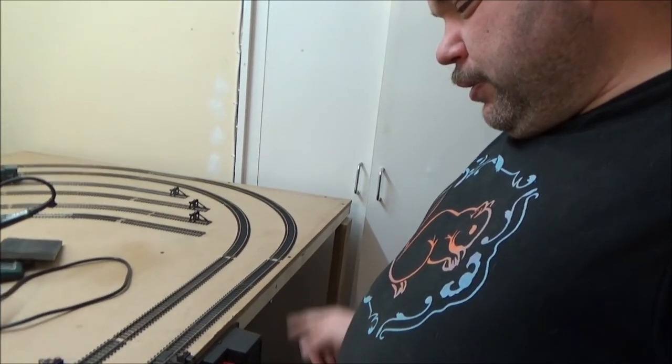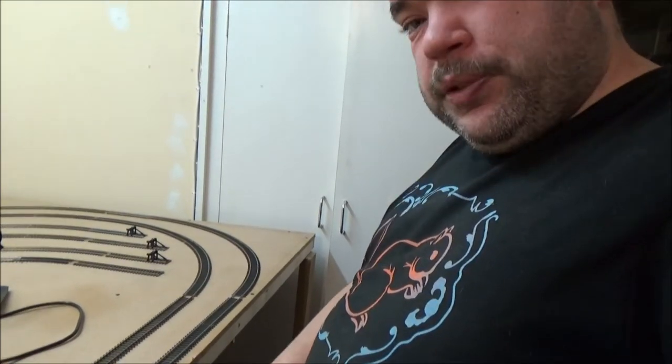So in total, I really need three project boxes to make three switch panels up. I've ordered some LEDs with resistors for a 12-volt supply because I want a visual indicator for those sidings, so I know when a siding is turned on and don't accidentally leave it on. When the siding is on, a little LED will light up. But I think this is a 16-volt power supply, and if I decide to use another one of those I might have to change the resistors to ones suitable for 16-volt. I'm going to double-check that power supply — I'm pretty certain it's 16-volt.